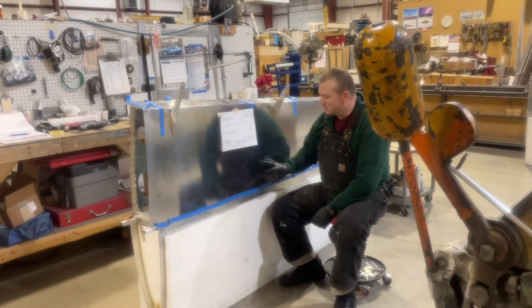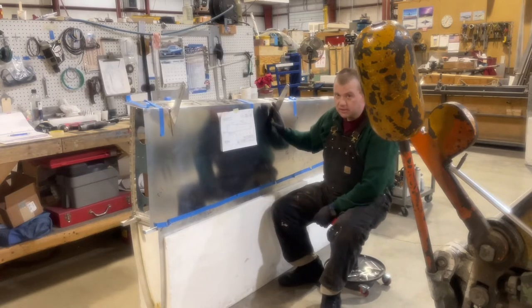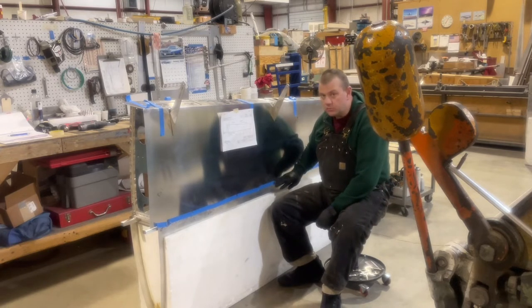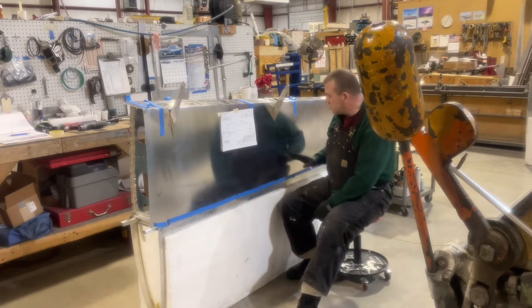Right wing bottom skin is in place, have the slots cleaned up, rounded out the bottoms, filed off the edges so they're nice and clean and straight, so everything lays nice and flush. It's time to start putting the rivets in, or drilling the holes to put the clecos in for the rivet spots. So with this, I start on the